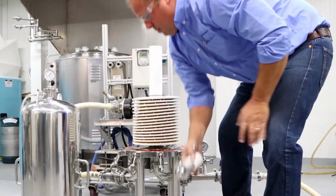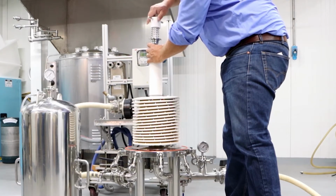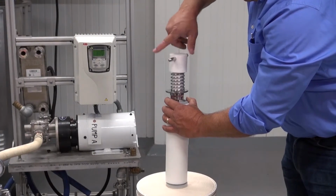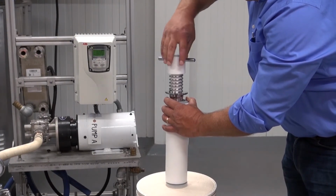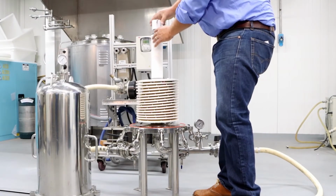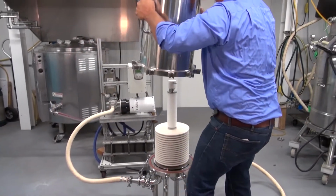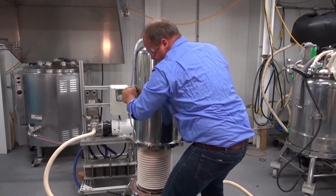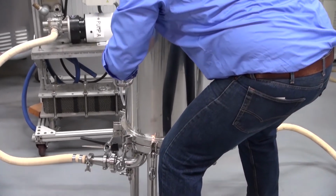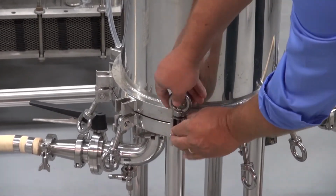Position the follower tube and filter nut assembly to make contact with the top of the cartridge and tighten 1 full rotation per cartridge and per adapter if used. Without shifting the base O-ring, carefully place the dome onto the base while aligning the swing bolt box. Tighten the swing bolts in a crisscross pattern.